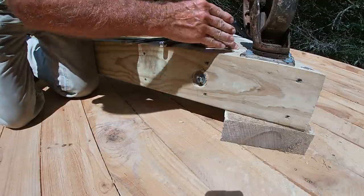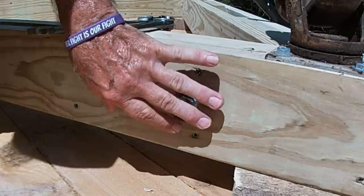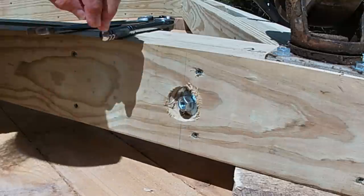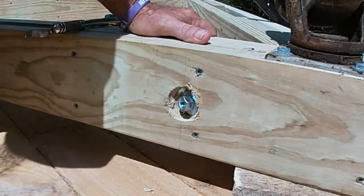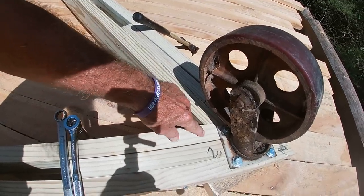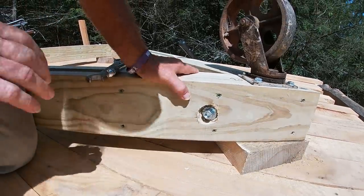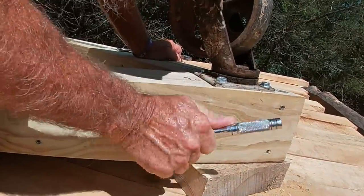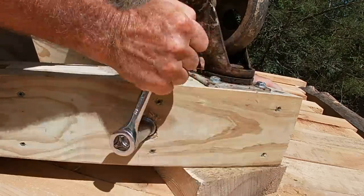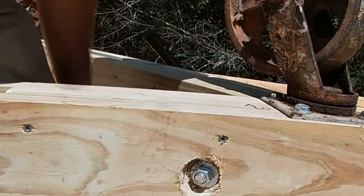When you're drilling a hole like this — it's pretty long — you want to try to drill as straight as you possibly can. I had the base turned over with a line drawn from one side to the other, and I used that to sight my long bit as I drilled the hole through. It gave me a real straight hole. The back angle right here where it comes together is where the bolt actually intersects — that's the strongest point all the way across. Now all I've got to do is tighten this nut, and this part of the hoist will be connected together. I'll do the other two corners the same way.